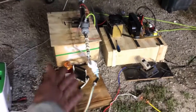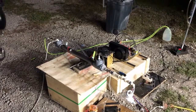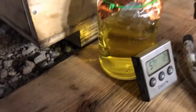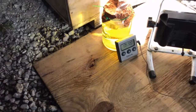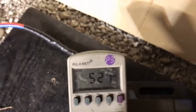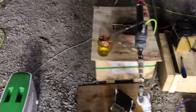After this test I'm just going to push it to the limit — we'll do 6 amps next, run it for three hours at 6 amps and go from there. We are one and a half hours in and look at that — dramatic change. It looks like apple cider now. We are definitely producing far more ozone, and this is a very good visual indicator. This is almost twice as much I would say, based on this speed. We're reading 5.2 amps, 823 watts, and I can smell that ozone from here in a completely open area.